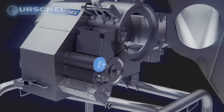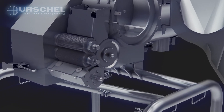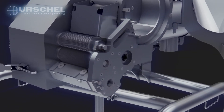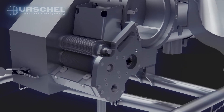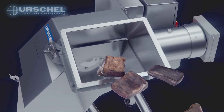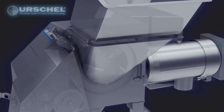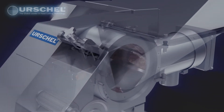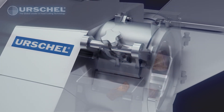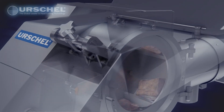On the cutting side, cantilevered spindles can easily be completely removed from the machine to ease cleanup and maintenance. An optional outboard bearing provides support to the cantilevered cutting spindles to triumph over heavy-duty applications, such as frozen-tempered bacon. The Integra's large feed hopper can accept in-feed products of up to 4.5 inches, or 114 millimeters. As the product enters the impeller, paddles move the product to the cutting zone, where slices are made initially. The easily accessible slice adjustment knob allows you to dial in and lock in a specific slice thickness to ensure precise tolerances throughout your production run.